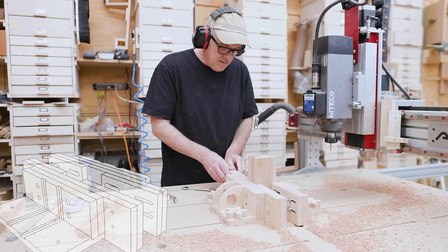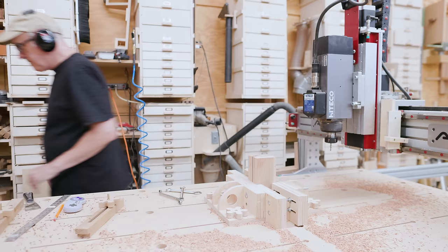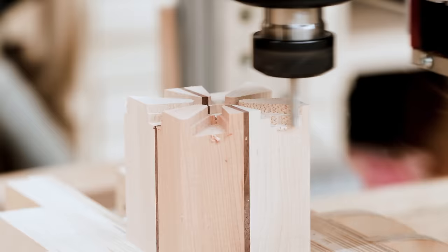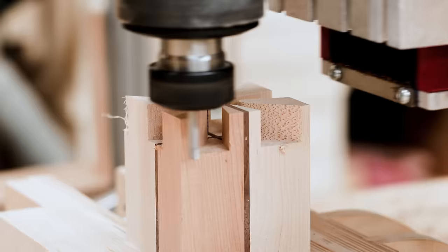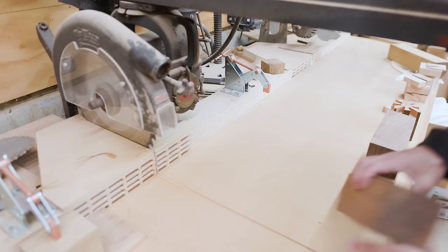I can start work on the joint between the handle and the head. I made a jig a few years ago for holding pieces upright on the CNC table — basically a wooden clamp — so I can cut the joint into both ends. It's a really good idea to flatten the end with the CNC before cutting the joint; this ensures the two halves are exactly the same depth, which is important for this joint.